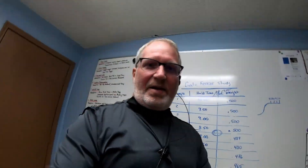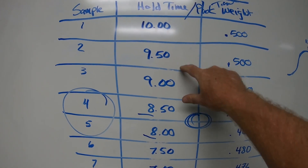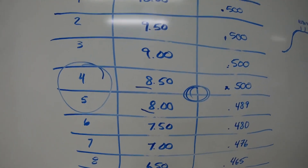That's everything you need to know on gate freeze study. Again, you can start at 10 and go to 9, 8, 7, 6 in full increments rather than half increments, and put your part weight over here. I always take a china marker or a marker and mark sample one with the time that I used, write down how long the time is, and go from there. That's your study basically.